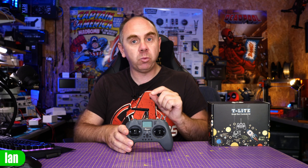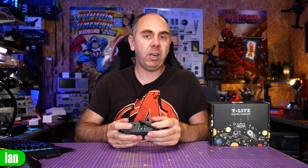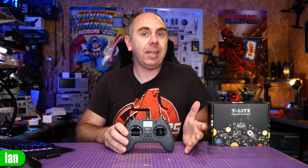To share my final thoughts on the Jumper T-Lite version 2: I really like this radio and I think it is one of the best gamepad-style controllers out there. It has built-in ExpressLRS, removable battery, trim controls, Hall Effect gimbals, decent plastics, okay switches, and good build quality. Literally the only complaint I have is that it doesn't have a neck strap or lanyard hoop. It is interesting that all of these little radios are compromised in one way or another - limited switches, poor battery life, or limited controls - but I think this one has the least compromises of all of them. If you're looking for a game-style controller, this one is probably worth a look.